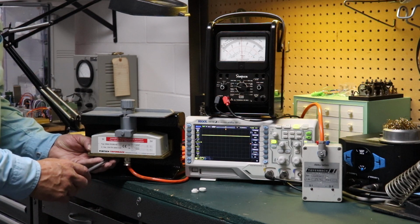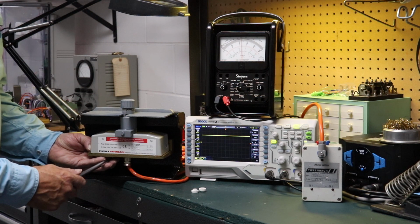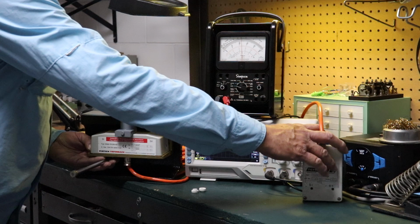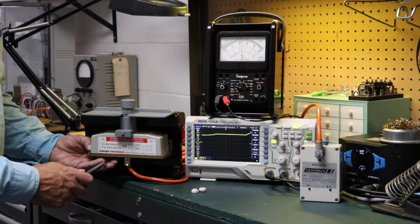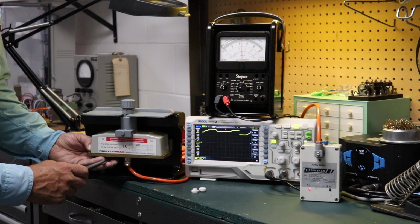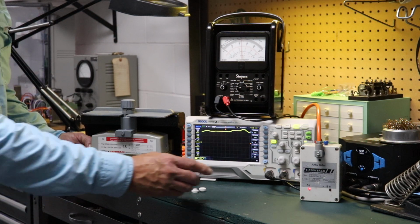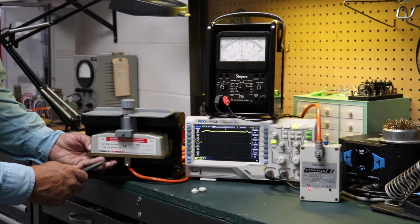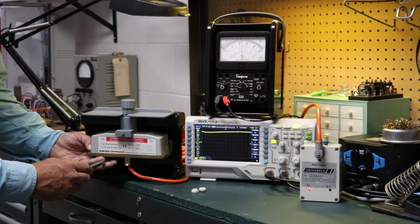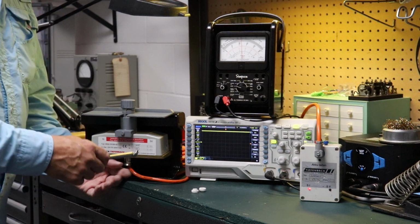Release the spring. Now I'm going to begin to increase the sensitivity of the sensor until this guy just turns on. And you can see I just turned on here. So I bring it up till it turns on, I back it off a little bit, and then I bring it right back up till it just turns on at S1. So S1's adjusted.